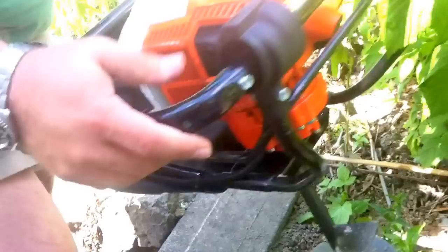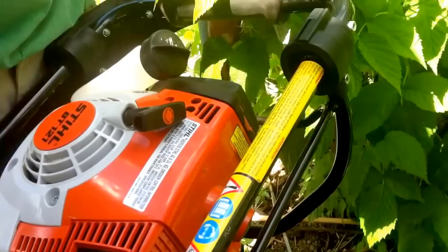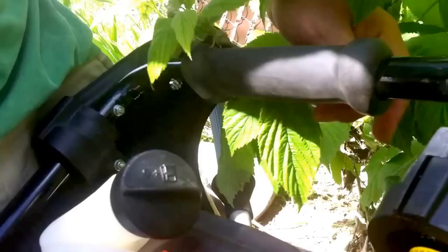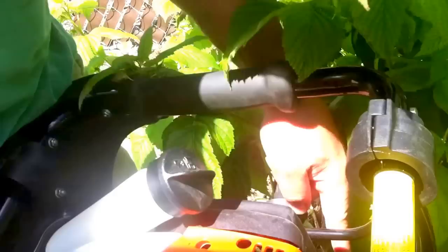This is the auto kick function. What the deal is on this is it's a clutch that prevents this from torquing and wrenching your wrists. I've used it a lot, I'm impressed. You have to basically keep this towards you so that the auger spins. If it pops and spins on you, your hip bumps it, and so it prevents you from wrenching your wrists. When you start it, you put it in this position so the auger doesn't spin.